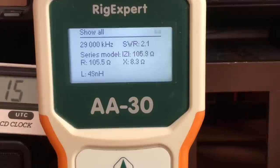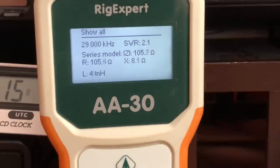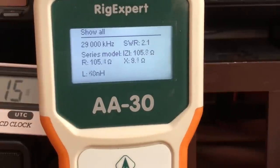So what I'm going to do here is I'll probably tune to 7.030 and just send some basic test CWs, just to see what the Reverse Beacon Network comes up with. And I'll share the ones from last night as well, because some of these frequency bands are useless during the day and some are useless at night. So I'll show you everything I've done since I've had this antenna in the attic. So I'll be back later on, guys, if I don't end this video.